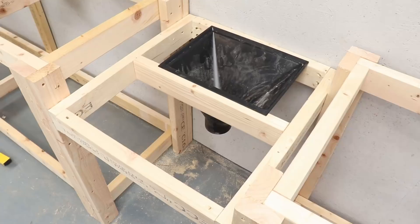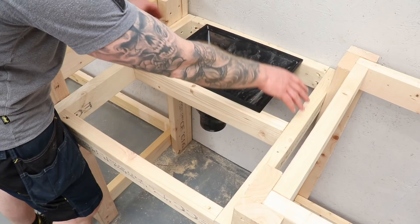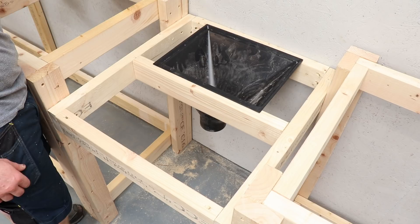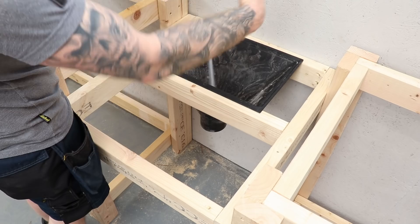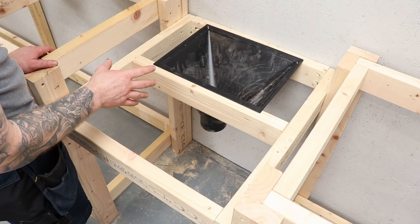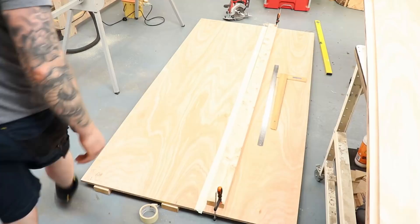There's the frame for the miter saw stand. This is the cowl that's going to sit down here - I'm going to make a piece of plywood to suit it, and take my flexible hose down to the worktop. I may have to cut this stretcher out to make room, but I'll frame that in so it doesn't weaken the worktop. When the miter saw kicks all that dust back in there, it should drop down and get pulled out through the hose. I'll also need the shop vac hose up here. Next move is cutting the plywood tops.